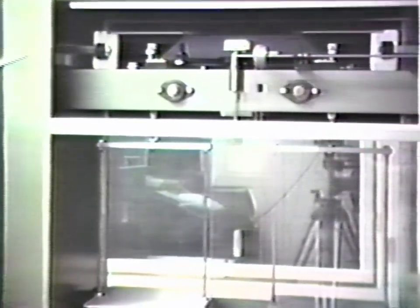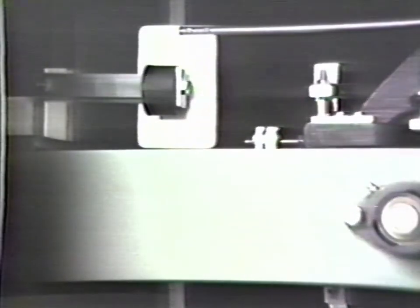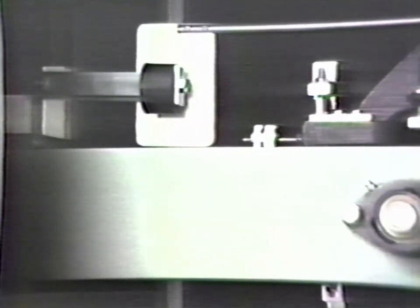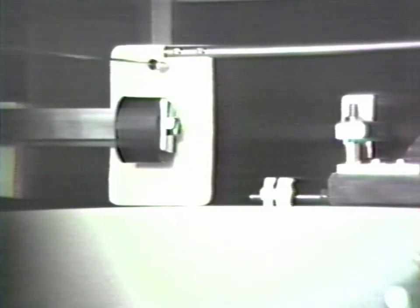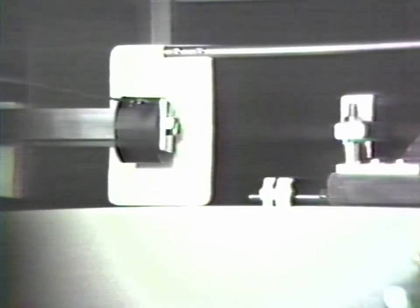Several other devices are used on the HCE series balances. A magnetic damper is used to determine the equilibrium position of the beam instead of allowing it to oscillate. This saves considerable time in making a measurement. The magnetic damper consists of a non-magnetic vane, in this case aluminum, passing between a fixed magnetic flux field provided by two magnets on each end of the balance,